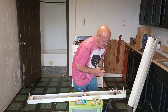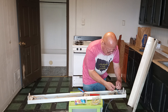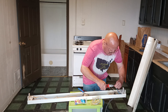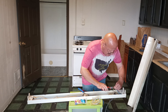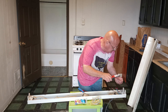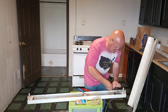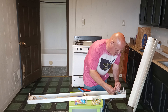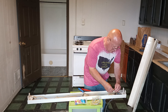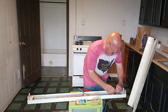I'm going to take my pliers and get my insulation all even at the bottom, just like I do with regular 14 and 12 gauge wire — get all our insulations even at the bottom. I'll twist our solid wires together, clip our ends so they're all even, then loosen up the strands on the black wire and wrap the stranded wire around the solid wire. We'll stick the wire nut on, making sure the insulation goes up into the bottom of the cap but not into the spring, and twist it all nice and tight.